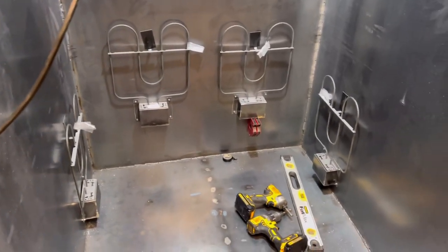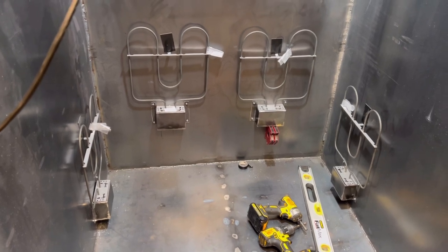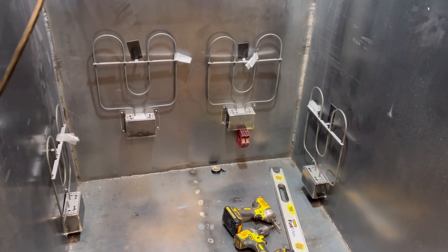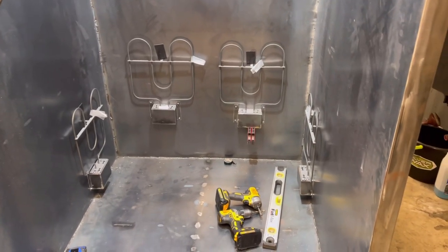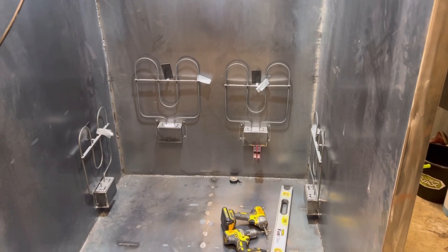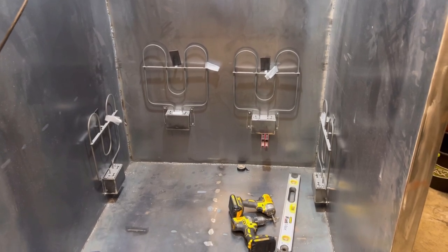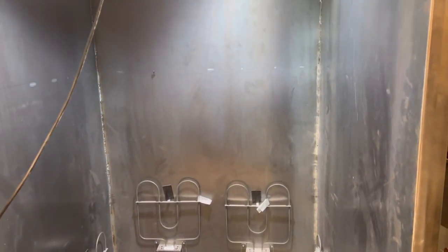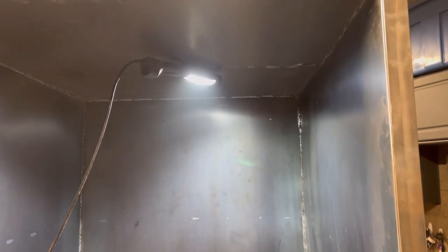All the elements are mounted. We still have to do the wiring and the top brace where you see the black tape — we'll get to that once we're ready to wire everything up. Placement is perfect. The left and right panels are lower, the back panels are higher. With this oven you'll have full control over your elements — you can run the two back elements at startup and then add left and right as needed depending on what you're heating.